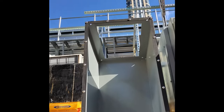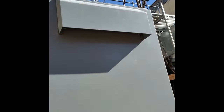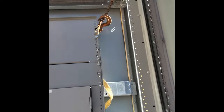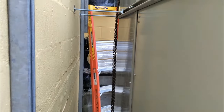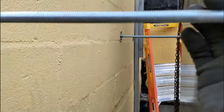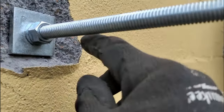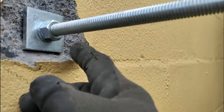To mount it on the pad was a problem — being that it was on the roof they wanted us to lift it up off the pad as well so the roofing guys could waterproof underneath. The roof guys would not give a warranty if they weren't able to waterproof underneath the gear. So I had to lift it up a few inches so they could get under there. Being that the gear was top heavy, I went ahead and bolted the back to the wall so it wouldn't tip over in the future.